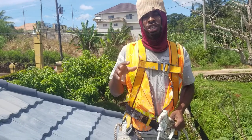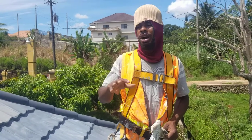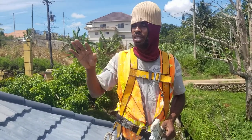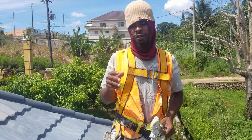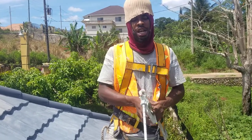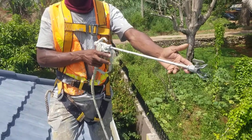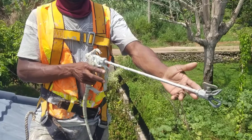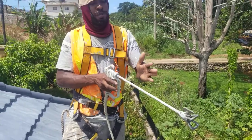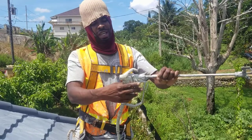So I just wanna share my little tricks and little techniques with you, how I go about spraying a roof. So first and foremost, I'm using a Titan 440 impact machine, and I'm using about a 12 inch gun extension. This gun extension saves me from doing all the bending and stuff like that. And I'm using a 2-finger gun, as you can see.